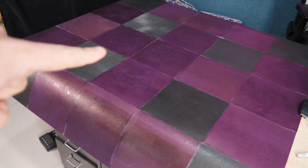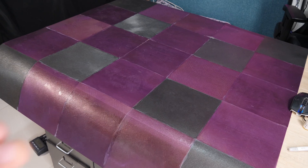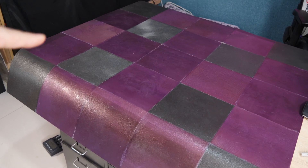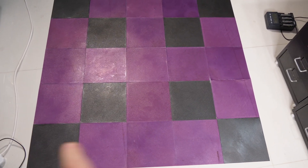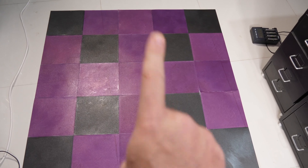So if you take this, flatten it out and make it one square meter with the same weight — I did this. These are 25 pieces of 0.1 millimeter layer height, printed 20 by 20 centimeters, stuck together to form one meter by one meter. They also weigh four grams each, so together that's 100 grams. What we have here is one square meter and 100 grams — ergo one newton over one square meter means it's one pascal.